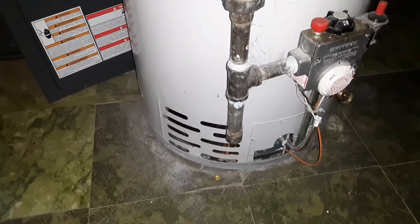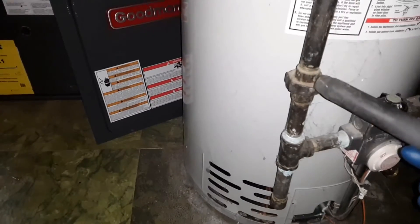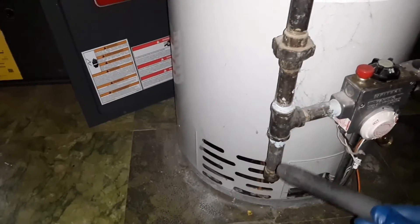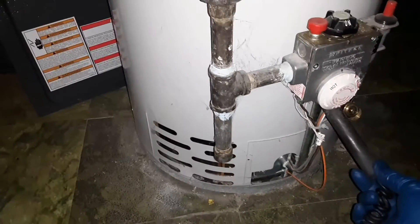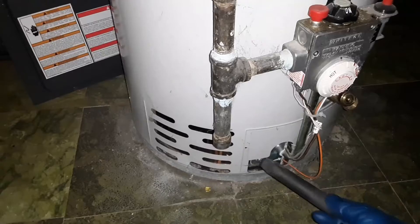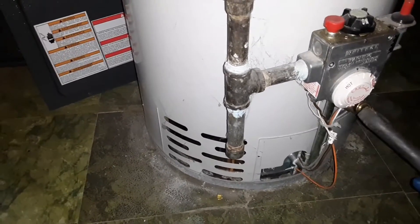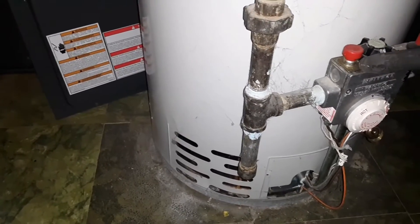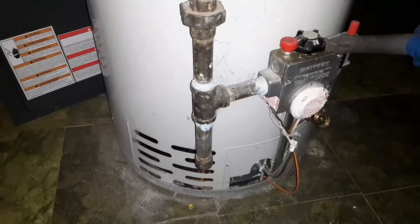There's a pretty good gas leak on the gas control valve of this water heater right now. I've gone along and checked all of these lines here, and as it enters into the gas control valve, I'll check the undersides where the gas is going into the gas control valve or the gas burner area. In this case, I noticed it was at the top area here — the control valve itself can have gas leaks also.